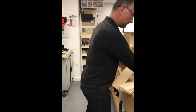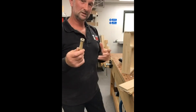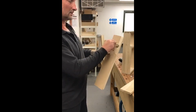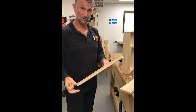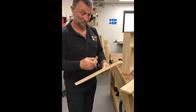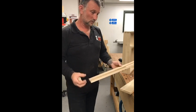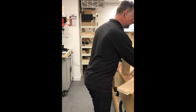Okay. Now, we're going to be using this cutter, which is a trimming cutter. It's a bearing guided trimming cutter. So trying to use this cutter to remove all that material in one is a big ask. I know people do it and they just rip the material out, but what worries me is overload on the machine itself, because there's a lot to ask, and just splintering. I'd rather trim off a little bit than rip out a big load of material. So I'm just going to mark up where I've got a tiny little bit to remove.